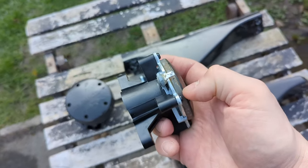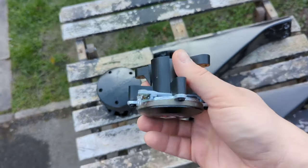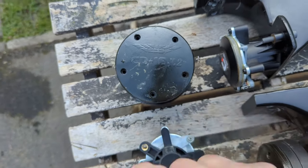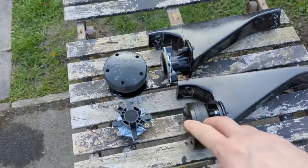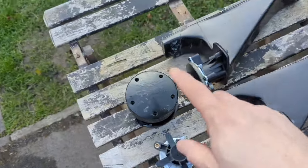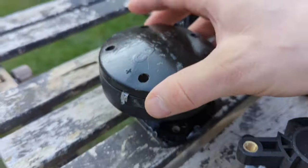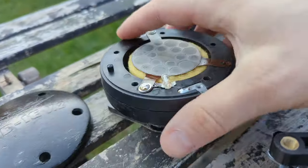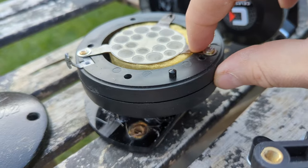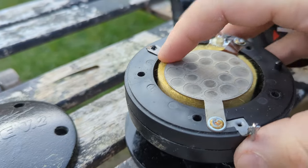These have a neodymium magnet and act similarly to a tweeter - very compact with a throat and a mesh. I'll be comparing how these compare to the original CDE1 V2s. One of those was faulty - during my testing one horn crackled and measured over 5% distortion. When I opened it up, it was bent - probably overheated - which caused the distortion.